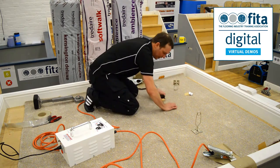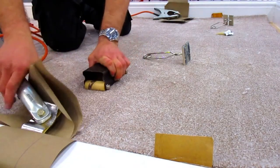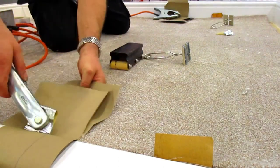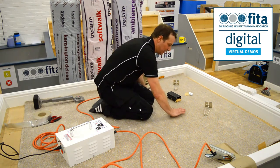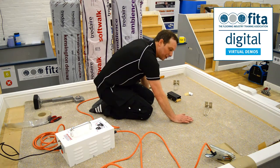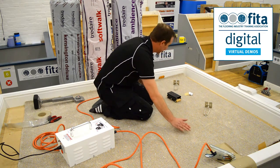You can still work on the join as it's heating up. Give yourself a first roll — smooth roller only, no spikes, you'll distort the pile. Just a couple of minutes more. This join has to be set up before you start. With your heat bond join you've got a bit of movement and can juggle about, but you really need to get this set up and just start — it stays where it is.